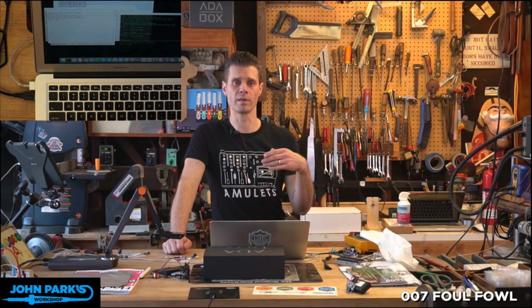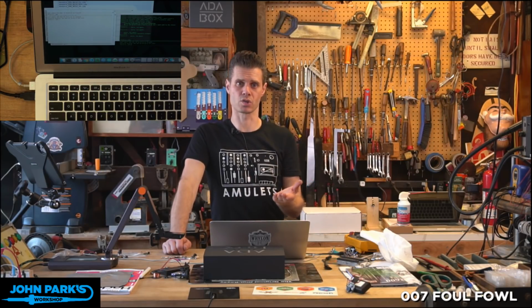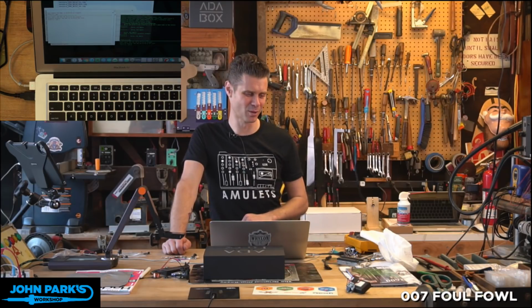In the case of the rubber ducky from Hak5, there's a whole scripting language that makes some of this stuff easier. So I'm really either using keyboard shortcuts that run system-wide or per application, a mix of that with terminal commands. But it's definitely conceivable that you could come up with your own scripting language and have separate payload files. And that's how it works on the Hak5 rubber ducky. There's a small text file that contains just the list. If you think about what was at the bottom of my code, where all I said was open a terminal, type a thing, close the terminal, that's the sort of level of the scripting language that you can use, which is great. It makes it a lot easier for a lot of users and office pranksters, hopefully, and not nefarious people.